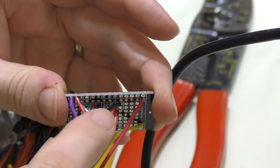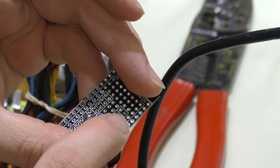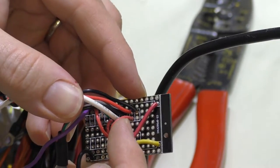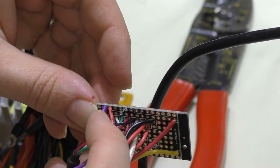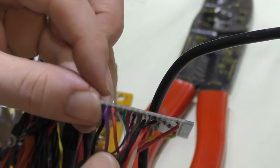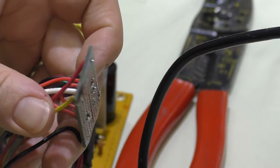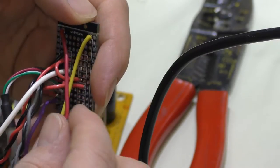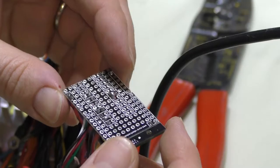What I did on this circuit board was bring all the connections out across these pads, so each one has its own adjacent pad — on the other side you can see a little square, meaning this pad and this pad are connected to each other. That allows me to make jumpers to various places. For example, these red wires will connect up to the USB and then go over to the purple standby voltage wire. I have a couple more connections if I wanted to tackle more things, but I'll leave it as is — that way you get the option later to do something if you want.